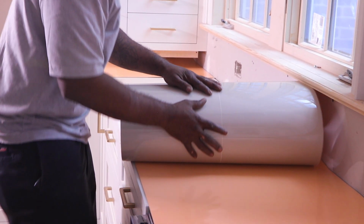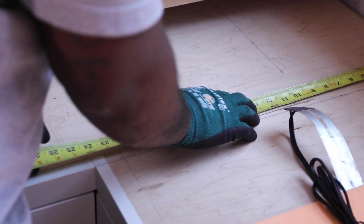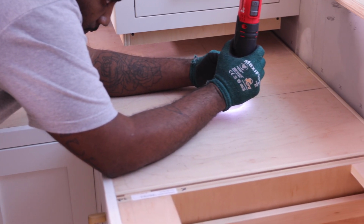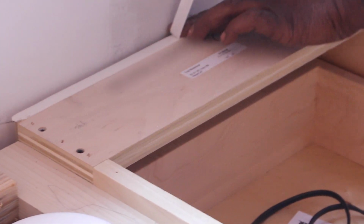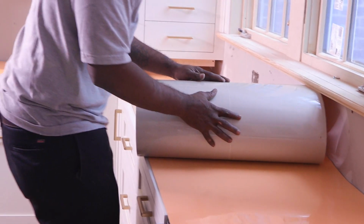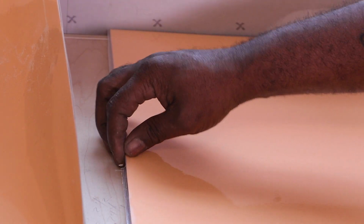Roll out the panel over the desired area on the substrate and take note of where the tabbed connection lands. Remove the panel and drill a small access hole to drop the connector and wire lead into when installing the panel. Prep your substrate by adding some double-sided adhesive tape. Make sure that the subsurface is smooth and free of burrs with no protruding screw or nail heads. Simply unroll the panel over the adhesive on the area you're lighting and drop the tabbed connection and wire through the access hole you drilled previously into the substrate.